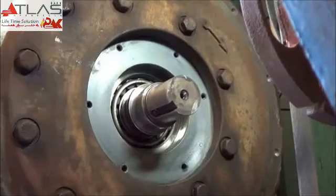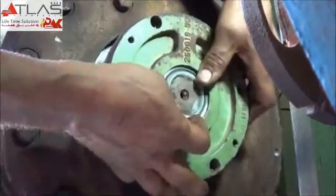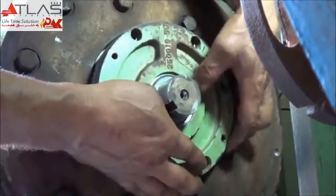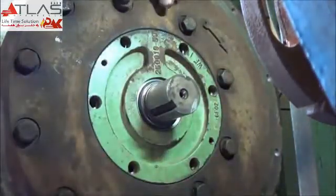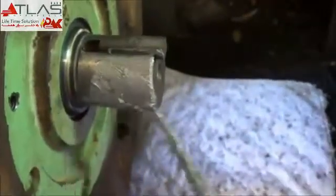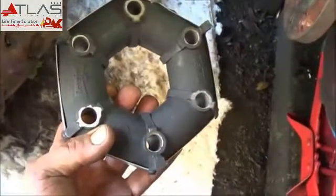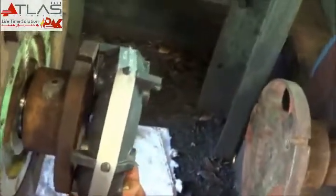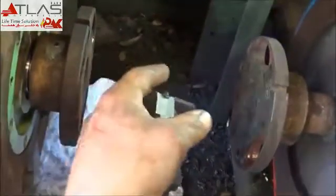Hopefully that worked out okay. We'll put some anti-seize on the old shaft, make everything look nice so it comes apart again nicely. I've been working on this equipment at the same plant here for almost 20 years now, and I'll be the next guy to take it apart — so do yourself a favor. I've got my new coupling here. I'd like to just put it right in here, but I don't think I can get the bell housing on with it in place, so I'm going to have to do my work inside the hole here, which kind of sucks, but it is what it is.